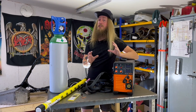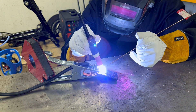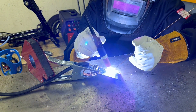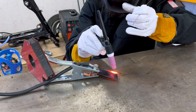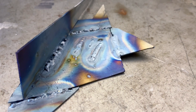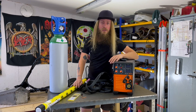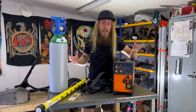I quickly moved on — probably too quickly — and I started to dab some filler, and it worked fine. I also did a fusion weld with these two pieces of 1.2mm sheet. I did try a fillet weld, but let's not talk about that. Once again, I have nothing to compare it to, and I have only spent a few hours fiddling with this. But I'm impressed — it actually TIGs.